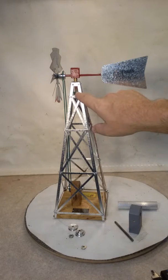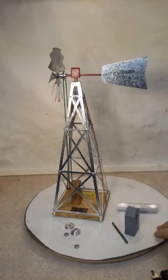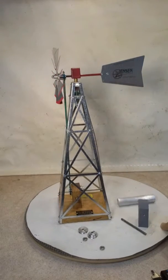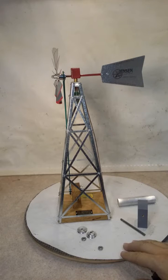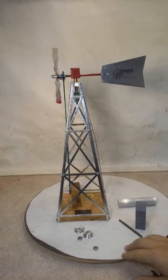And what I'll do is I've got a little belt sander, and I'll put the shaft on there and kind of run it around a time or two to get the red paint off of it and to thin it down just a little bit because it's a little oversized 1/4 inch. Really hard to thread. And then the ladder is painted red, and the ladder and the fin blades are all fire red. That's the color they used. The belt here is 27 inches long exactly, and you want it to be a little loose because this is just, remember, just a bronze bushing there, so you don't want to put too much pressure on it.